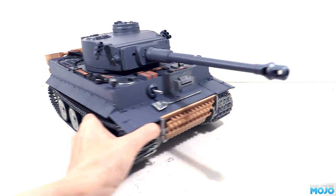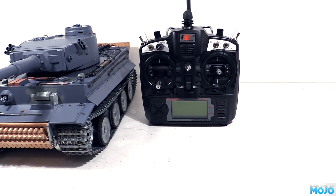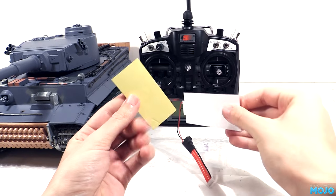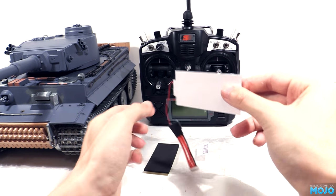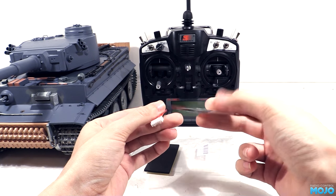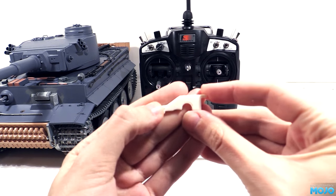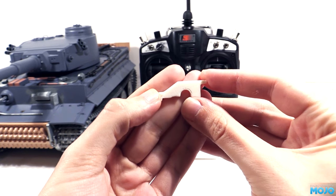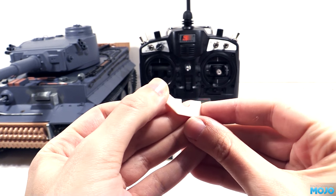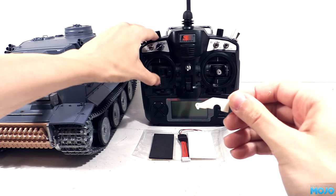So this week we're going to make a start on the mods on the Flysky 9X Transmitter. We've got a couple of bits to add. First is a white backlight. You get a thin foam pad to replace a thicker one to allow for the extra space the backlight takes up. For a basic install it doesn't need any soldering - it just plugs into an existing connector.